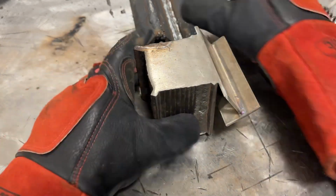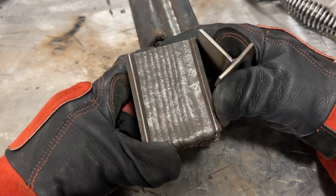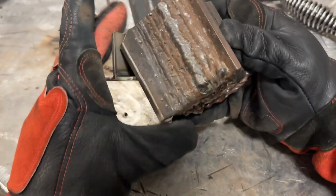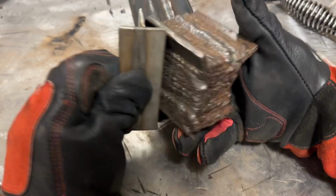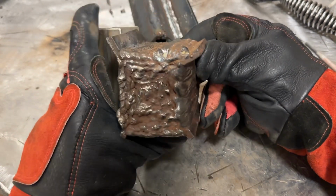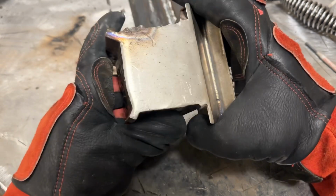This was pieces like this in an X pattern, and as an assignment, you had to weld this whole thing out with, I believe, that looks like 7024 or 7018. That looks like 6013 maybe. This is probably 6011 or 6010. This is 6011, this is going to be 6010. And we had to weld this whole thing out. And mind you, this is only half of it. So you can imagine the hours and hours and hours of welding on this. And then it was saw cut in half.